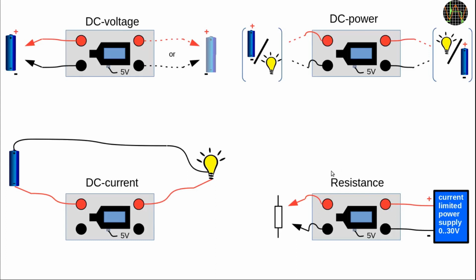As you have seen, the TC66 shows resistance directly, but limited to 1 decimal, which is really a shame because it has these highly accurate voltage and current readings, and resistance is really just dividing the voltage by the current. So unless the firmware is changed to fix that, to get more decimals, we must be content by reading the voltage across the unknown resistor and the current flowing and use a calculator or a spreadsheet to do the division. Unless you do the resistance calculation as part of a power measurement, as in the previous example, you will need a current limit power supply.